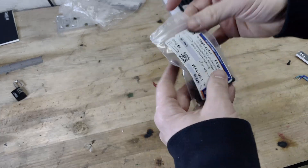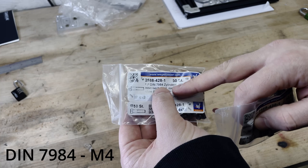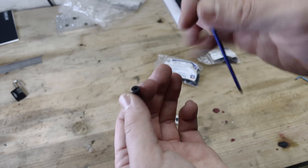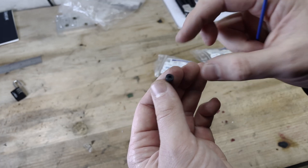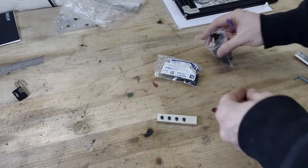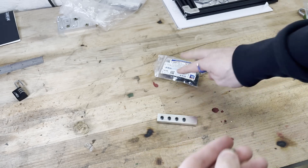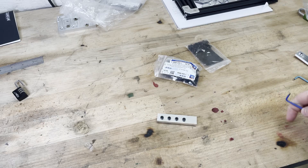I got sort of lucky with some of these screws. I ordered two packs - one M4x10 and one M4x8 - those are the ones with a small head. The hex driver is also quite a bit smaller: a 2.5mm hex key with a 7mm bolt head, so I have quite a bit of material I can machine away without compromising the grip of the tool. One pack fits really well with not a lot of play, but the other pack feels more worn - same manufacturer, but these are a bit looser.